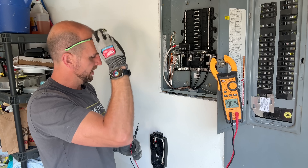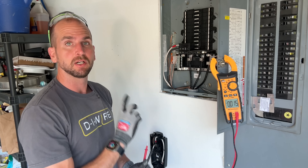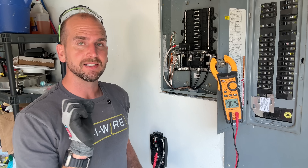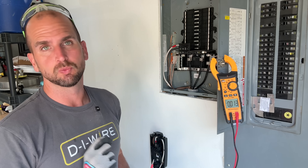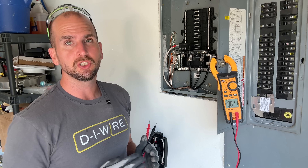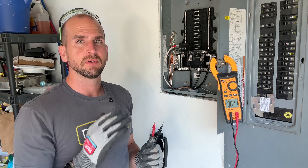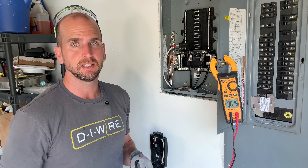The wiring looks good. Now let's get everything mounted up, plug into the Tesla, and see if we're pulling over 11 kilowatts — which is what we should get at 48 amps and is about as good as you can get for a Tesla at home. If you're pulling lower than that, just know it will impact how long it takes to charge.